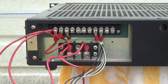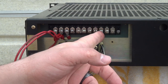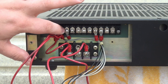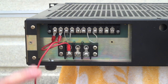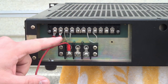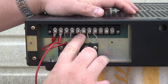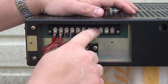I do believe that is the current adjust — pins eight and nine. So let's go ahead and pop all these out. We will have to install jumpers here, which it looks like the jumpers were eliminated by the previous user. We're going to have to attach the sense lines to make sure the unit has local sensing. Now I've removed the extra wiring and installed the other two jumpers that were missing. This one here is a nice metal jumper, but because they were removed, I had to use the existing wiring to make my jumpers.